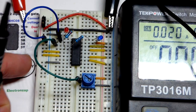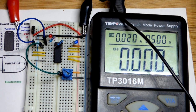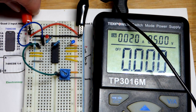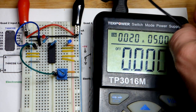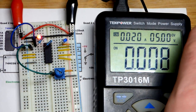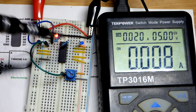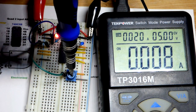I'll slide this over and move the lamp to a better spot. The power supply is off and not even fully connected. Again, with integrated circuits, discharge yourself before touching the IC or anything connected to it — a static spark can easily fry it. Both inputs low: the output is high and the red LED is lit up. The red LED cathode goes to the negative supply. I'll turn the trim pot to set input B high — the LED stays on.